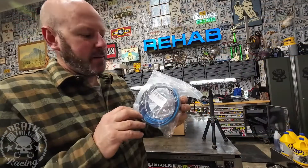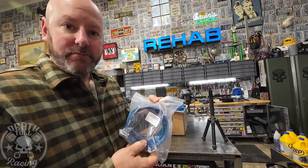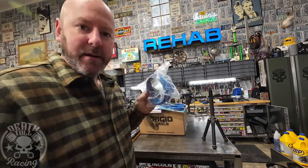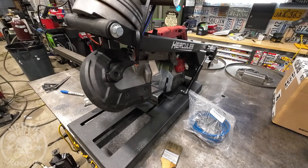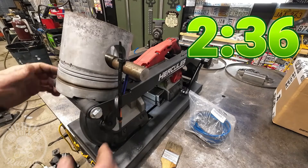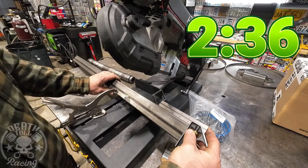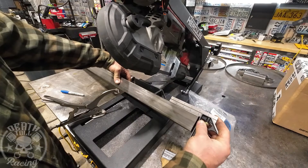Next up for one penny more are these Fox BC blades at $21.99 for three. There is no information on the packaging about anything, so one can only assume they're made in China. The first cut with 40 ounces took 2:36 — a lot better than the 14-plus minutes of the one before. Squareness is pretty decent one way, but not perfect the other — going to give this one a 7 out of 10.